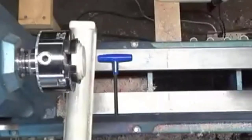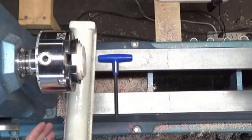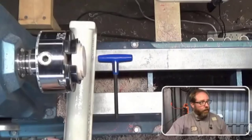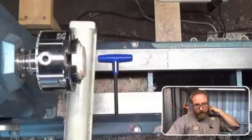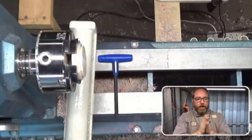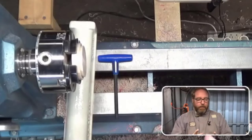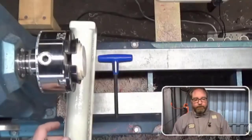So you're really not putting very much pressure on the ring during the glue. No, again, if you've gotten your glue joints nice and flat, you don't need a ton of pressure, I don't feel. It's much like when you're gluing up the segments into the ring. If you've got your joints, your angles correct, the rubber band is really enough pressure to hold everything together.